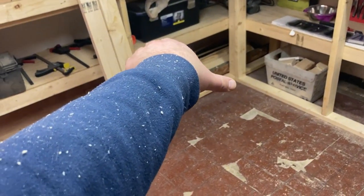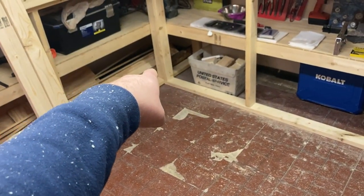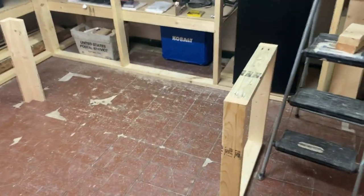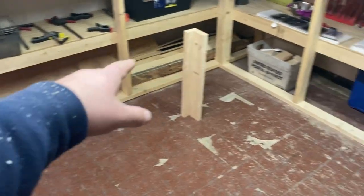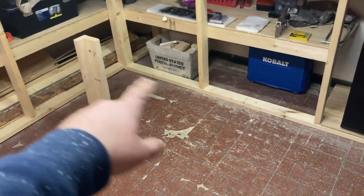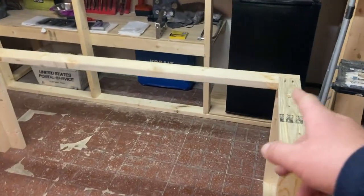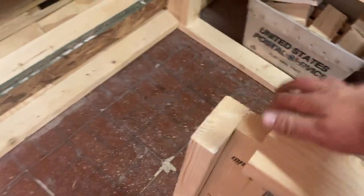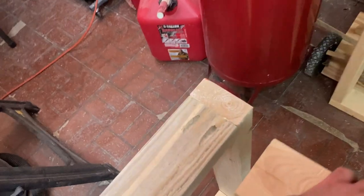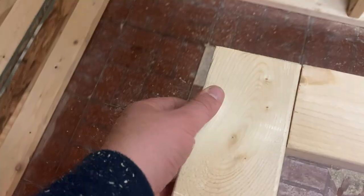So I've got the two frames built on the side and it's going to be an L-shape, and right between them in that back corner is going to be two 2x4s in an L-shape. Now I'm going to take my 5-footer — it's going to go from the right side with pocket holes on the top — and then this L-shape with the 2x4s is only a 2x4 short of what the frames are, so when I put my pocket holes in that frame it sits nice and flush right on top.